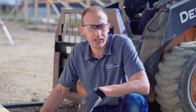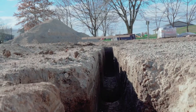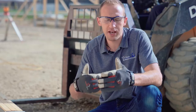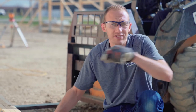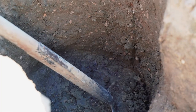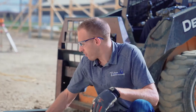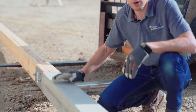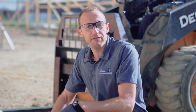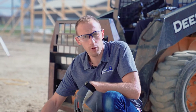This is a light commercial project with a trenched insulated grade beam that's two feet deep, ten inches wide, with two inches of styrofoam around the outside perimeter. This permacolum is going to go in an 18-inch hole that's four feet deep. Here we have a PC6300 with PC20UA uplift anchors, which is an eight-and-a-half-inch uplift anchor for the six-inch permacolum series.